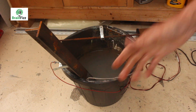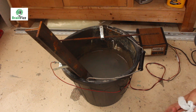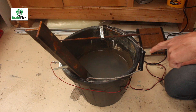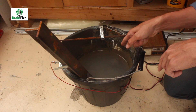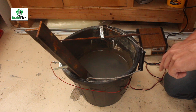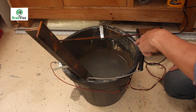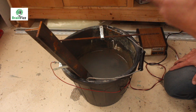I can feel that's quite slimy, which is good. Hopefully when I plug this in and put my 12 volts through it, the water will start bubbling and I can just leave it to bubble away. Now if I've got this the right way round, this will get really, really rusty and all the rust will come off there onto there. If I get it the wrong way round, I'll make the bit of metal more rusty and this less rusty. So I'll check it in a little while and make sure it's the right way round.